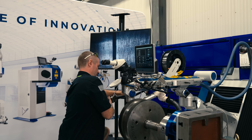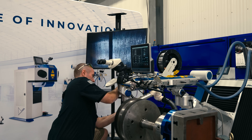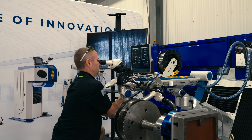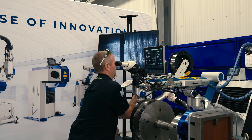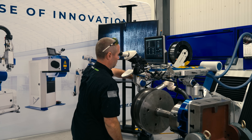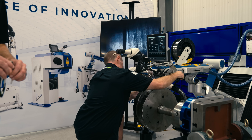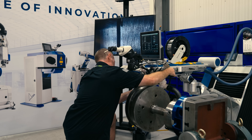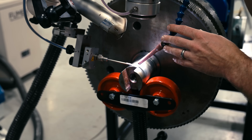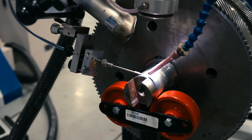You can also control the rotator with the joystick — he has a rocker switch where he can make it rotate clockwise or counterclockwise. The machine also has the ability to teach, so you can run a program on the shaft, or you can turn on the automatic wire feed, which we call semi-automatic mode. When he steps on the foot pedal to fire the laser, it will automatically rotate the part as well, and you can adjust that speed to get the right feed speed. Here he's adjusting the argon shielding gas so it covers the entire welding area to avoid any oxidation or contamination in the weld.